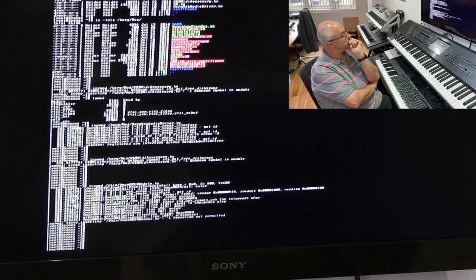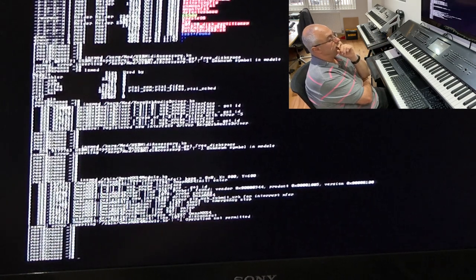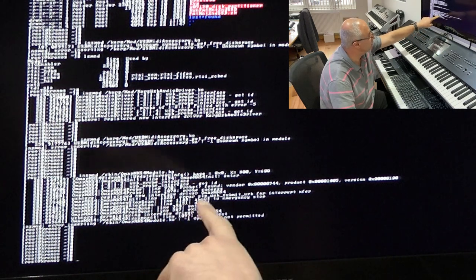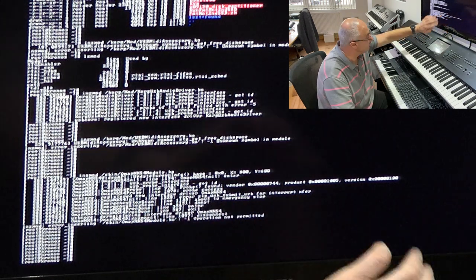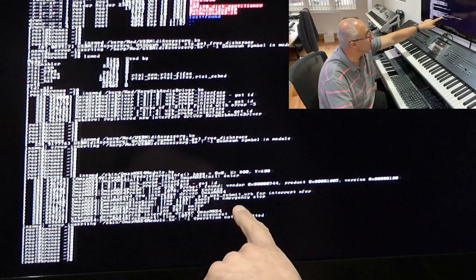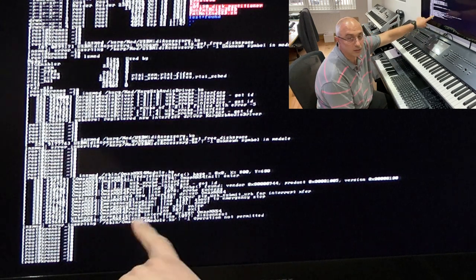Right, so what we are trying to load up in here is the nks4 module, which is the OMAP itself. We're trying to get that loaded into the system, but for some reason it's not liking it. If you can see, you've got the stuff in here. Notice these lines, this is really important. Line 970, probe found the vendor 944 and the product 1005. This is the core product, the core OMAP, and the version, and the probe success. So you can see the driver, and the new interface is being registered by the USB, so that's fine. But then it says error SDG USB submit URB for interrupt X transfer. It looks like the URB creation of the USB is not really successful, and that's causing the system to say, hold on a minute, I'm not going to carry on loading this.